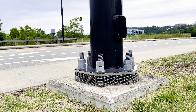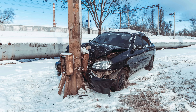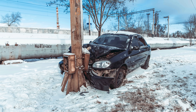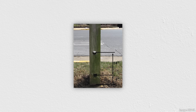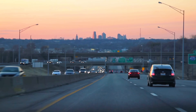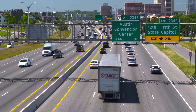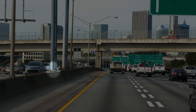A lot of state highway departments have moved away from using grout to make signs and light poles easier to inspect, and they often install wire mesh to keep animals out from hollow masts. A common misconception is that standoff base plates are meant to break away in the event of a collision. Smaller signs installed near roadways often do use breakaway hardware — holes drilled in wooden posts, bolts with narrow necks meant to snap easily, or slip bases. But for larger structures like overhead signs and some light poles, that's generally not the case: having one break away and fall across a highway could create an even bigger danger than having it stay upright. So even though they might look similar, standoff base plates are distinct from sign mounts designed to break loose in a collision.